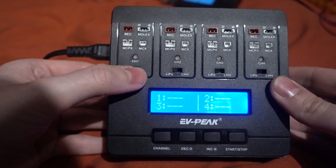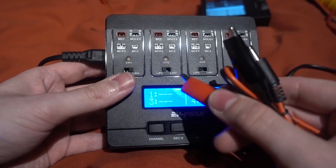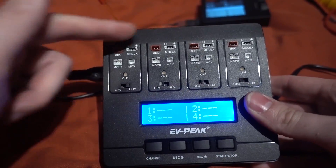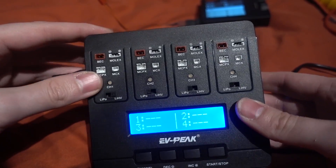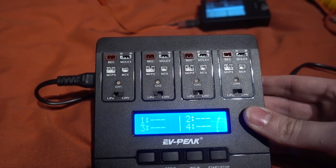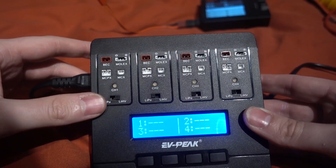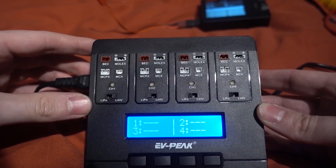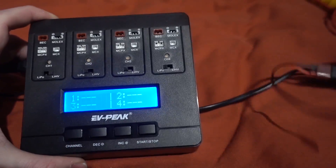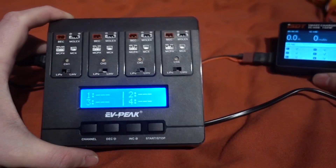The next thing to do is fully charge a high voltage LiPo on each charger, because this is where Bill says it's not fully charging them. I don't want you guys buying something that's no good. But if this works, this form factor is fantastic — it doesn't matter what you're charging, whether it's a brushless one-cell, a tiny whoop, or a brushed model. Everything is there, including high voltage and normal LiPo.